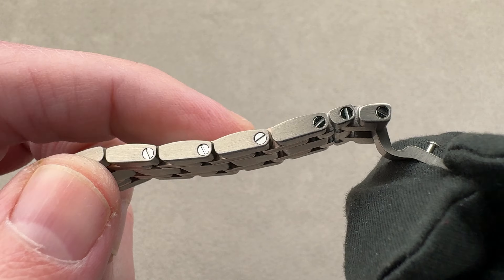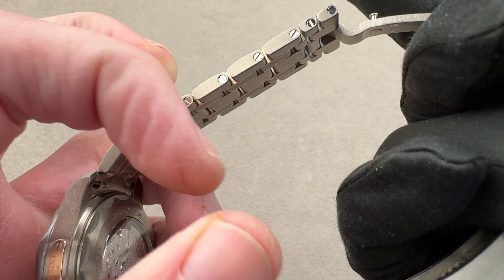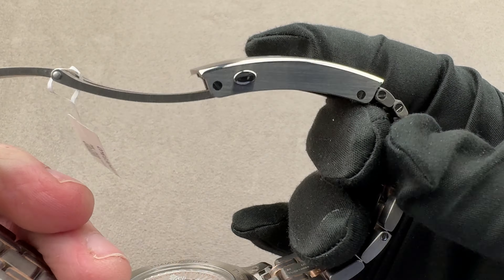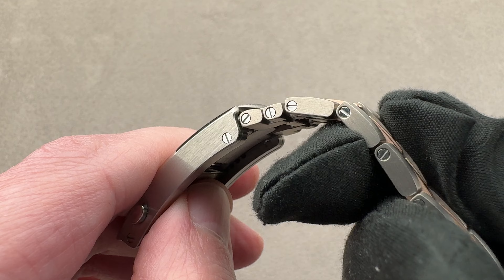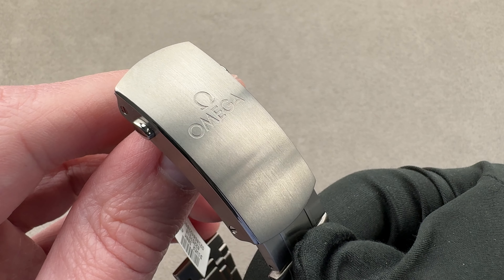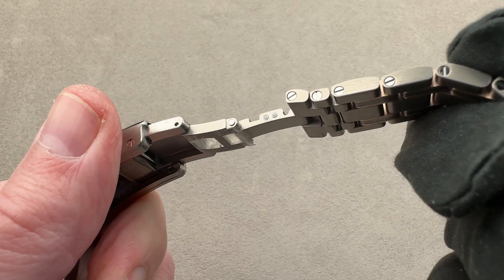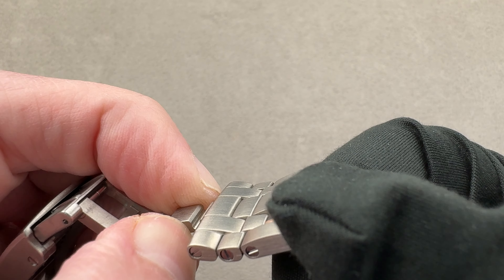Here is the cuff shot. It will slide underneath just about all jackets, but not all dress sleeves. The watch is incredibly ornate and specialized. You can see we have a tantalum bezel underneath a rose gold bezel insert, on top of a titanium case, and then the bracelet puts it all together. We have intermediates in that magical blue-gray tantalum material, rose gold flanking that, titanium flanking that. The pivoted end link does not stick out beyond the case — that does wonders for fit. We have removable links fixed by screws, and these micro links can be removed to fine-tune. Single-fold, thick-gauge swingarm in titanium. The clasp includes both polish and satin. Press the twin triggers and it pops open.